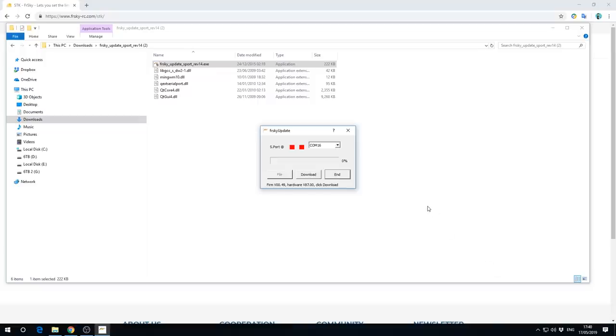To do the passthrough, go into the CLI and type 'serial passthrough 5' then the baud rate and press enter. That will prompt a power cycle. At that point close Betaflight, open the flashing tool, select the COM port, go into file, select the S-port firmware version, press open. Then plug the battery in — make sure you have all props off — and make sure your VTX is at low power because this takes quite a while.